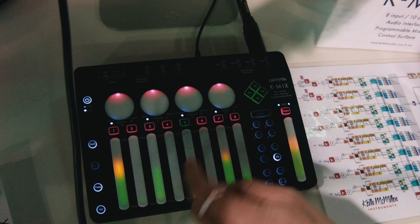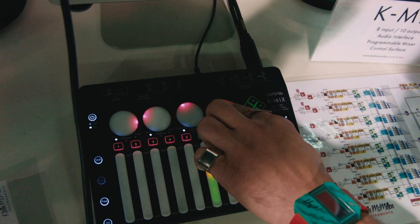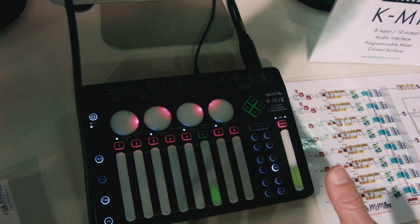So if we change some aspects of the music right now, like EQ and some compression — could you demonstrate that? If I want to EQ something, I just push this EQ button and I choose my channel — I'll choose the bass channel — and I can bring the lows up, cut the mids. All the effects run at 96kHz, so there's no down-sampling inside the board, and we're only using about half of our DSP, so we can actually add a lot more.